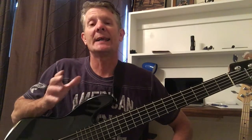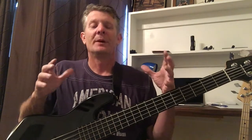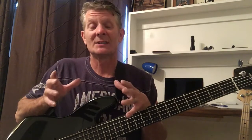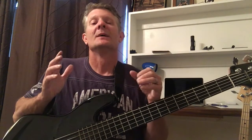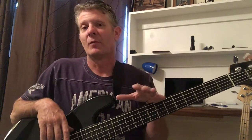Now, when you find that RMS number on there, most of your bigger brands will advertise this as, say, a PV Minimax 500, which is a 500 watt amp head at 4 ohms. So that's something else you have to take into consideration, is 4 ohms, and I'll explain that in a minute too. But that 500 watts, that RMS, that root mean squared number, is what you're looking for.